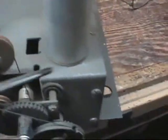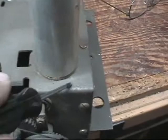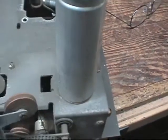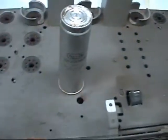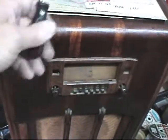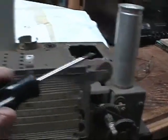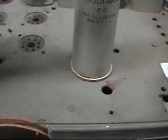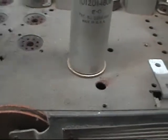If you look closely, this is mounted directly to the chassis — this can is fastened to the chassis. But remember me telling you about the bias on the radio, particularly the old 87K RCA 1938 radio, where it had those same electrolytics insulated from the chassis because of the 16-volt bias for the output tubes. This particular one is grounded here, but if you look over here, that's sitting on an insulated washer, so this can is not connected to the chassis electrically.